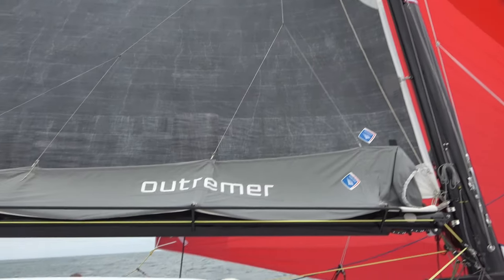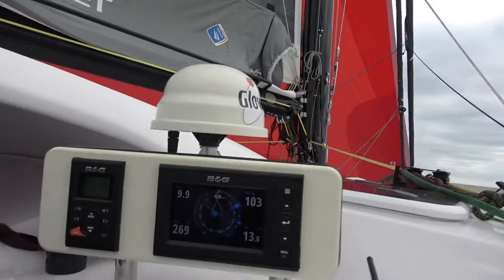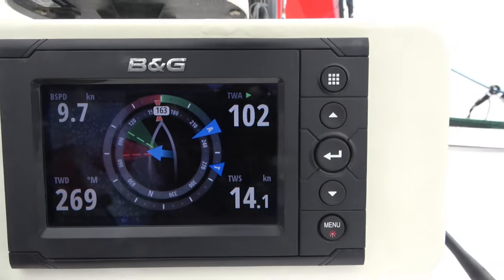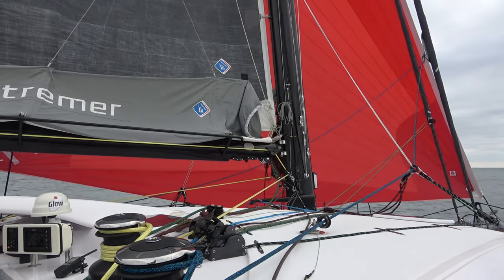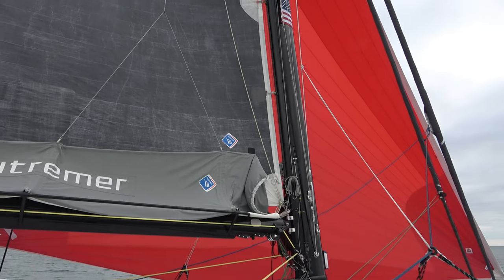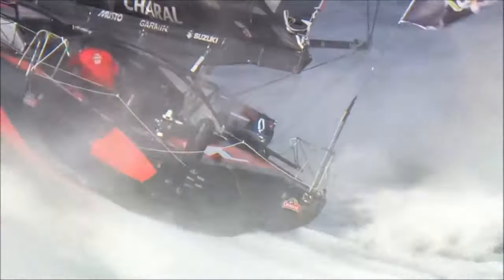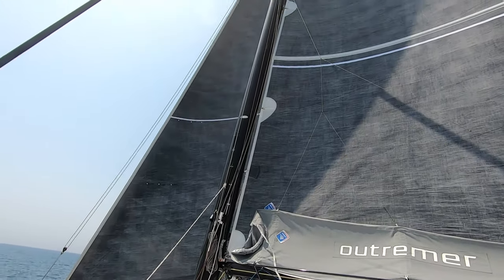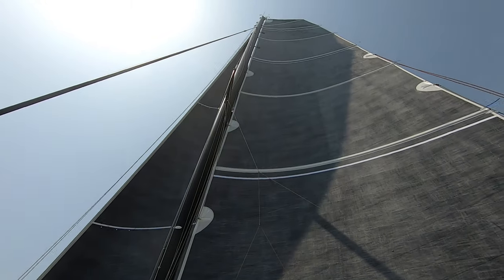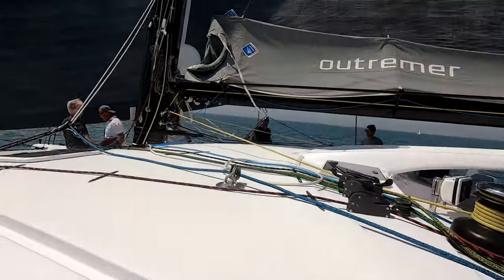So on a large cruising catamaran, which has a very wide beam, and the sails tend to have a very large roach, composites on the modern boats or the newer boats really make more sense because of the heavy loads and the large roach on those sails. The key to sailing performance is really reducing stretch in the sail, and that's where composites really succeed. So, tight sails are obviously a good thing when you're going upwind, but having a sail without stretch is also better when the winds pipe up so that the boat is easier to balance and easier to control.